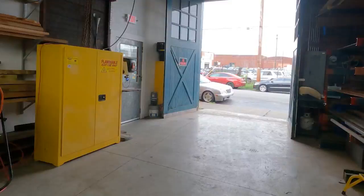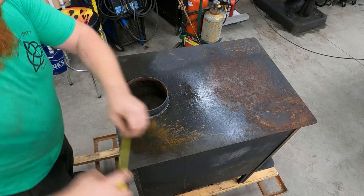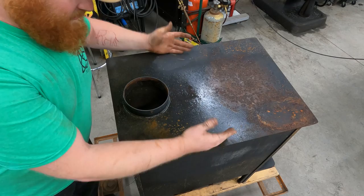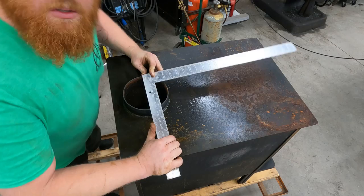So I'm sitting here measuring the top of this whole thing. This has got a pretty pronounced lip. This lip is an inch and an eighth sticking over top, roughly. So I've got some playroom if I don't want to make this quite as big. It doesn't need to be this big at all. I'm trying to figure out. So this hole is about 6 1/4, just under. I'm gonna make it 6 1/4 so that I've got enough room to weld when I put this back in.